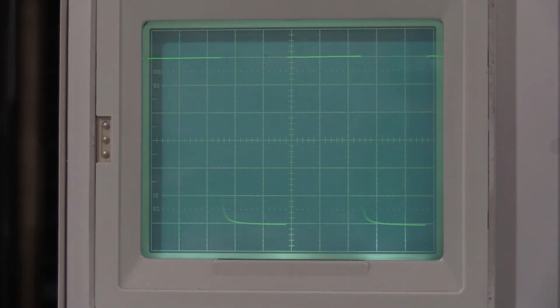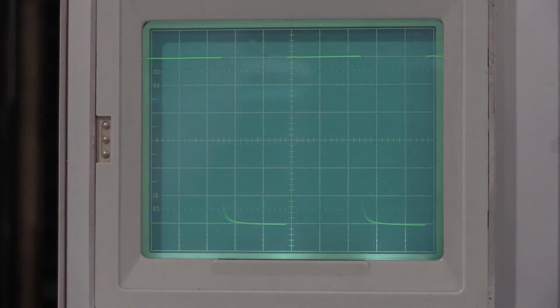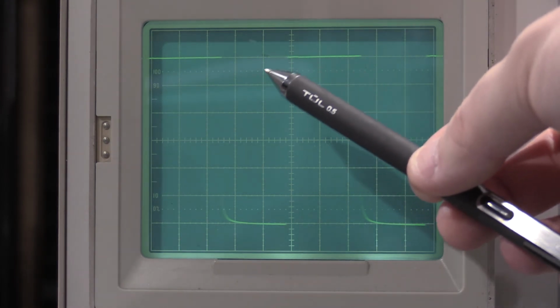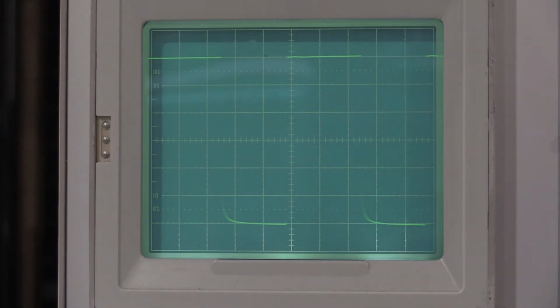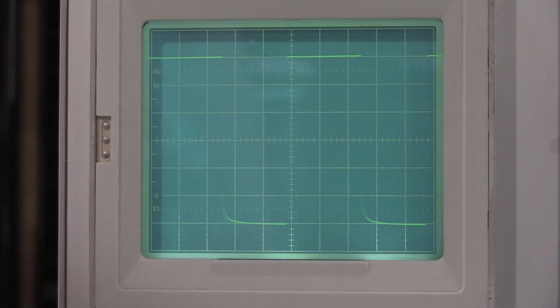All right, well, I was working on checking the vertical bandwidth, and it turns out the bandwidth was slow. So what that means, if you are working on one of these and everything seems to be working and frequency response looks okay, and your channel's slightly slow, it means this corner has been rounded off a little too much, and you've got too much attenuation or capacitance really in the signal, so your rise time is slow.